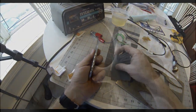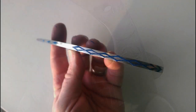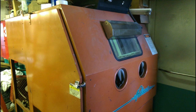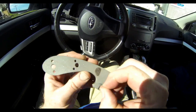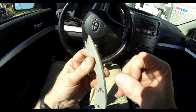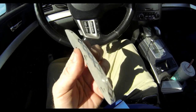Then I took some clear vinyl and created a covering for that maker's mark, putting a couple of layers on it. I also used some blue tape on the spine and cut out a design. The concept is just like doing etching — whatever is underneath that tape will stay shiny. This is my friend's glass bead machine. The knife is inside. It's a very fast process. After glass beading, the entire blade has that dull matte finish I was looking for — very industrial looking. Then it's just a matter of peeling the vinyl and the tape to expose the shiny logo as well as the shiny spine design. It's pretty cool to have a design created with the glass bead machine.